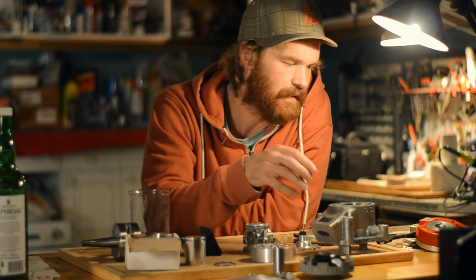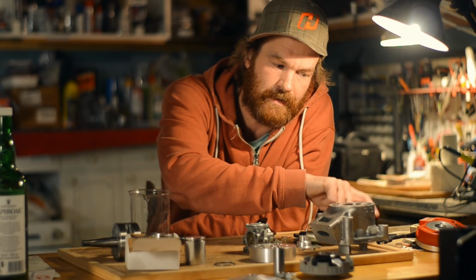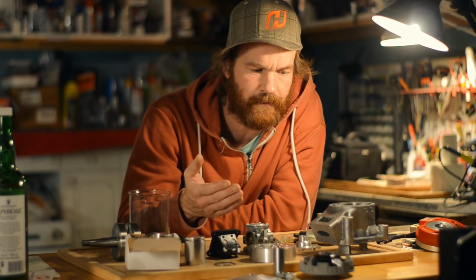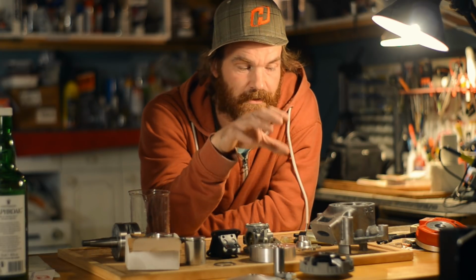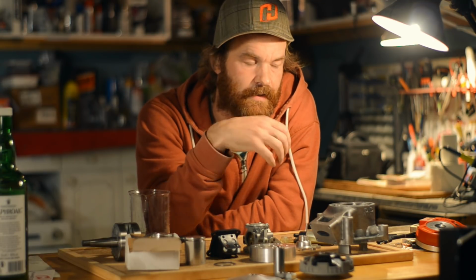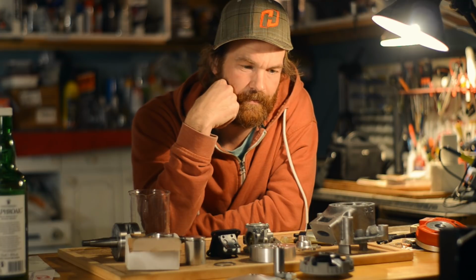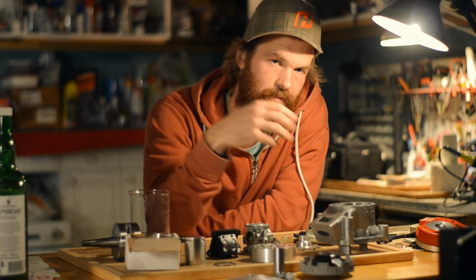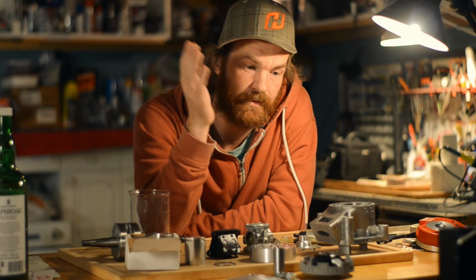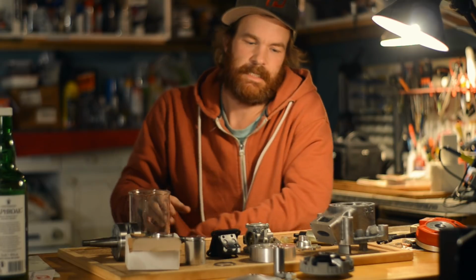Two-strokes have intake valves. Either a reed valve, or the piston is the valve, or the piston uncovers a port in the cylinder wall, and that's the intake valve, so it's piston ported, or a rotary valve, or a drum valve. But this new system I'm going to run, there's no valve. There's a gaping hole into the crankcase when I open that big intake. So the pulses will take care of the blocking and the transferring of mixture into the crankcase. The reason no valve is better than a valve is because there's nothing screwing with the pulses. That's the theory, anyway.